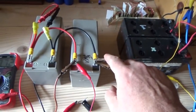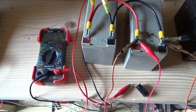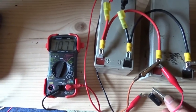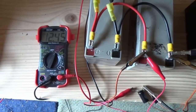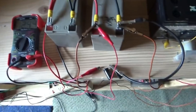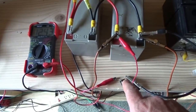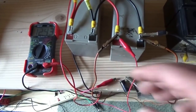Now I've got the clip on the negative terminal of the battery so I'm going across the battery. I have no idea what we're seeing here, but I'm going to connect that wire - boom - voltage jumps tremendously. I wonder if we're seeing a voltage stored in the capacitor because these are bad batteries. I'm going to take this out and measure the voltage of that capacitor to eliminate that possibility. We do have a voltage in that capacitor, so maybe what I'm seeing is that voltage overriding these - they're probably really bad.